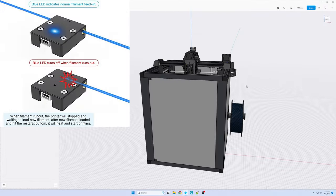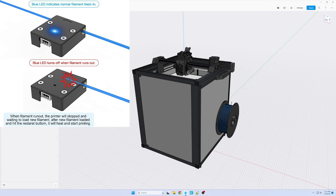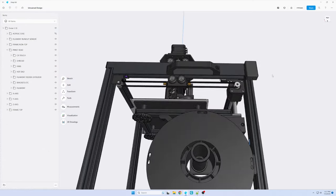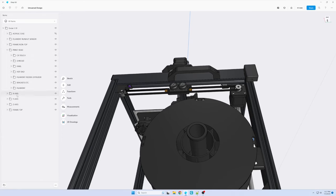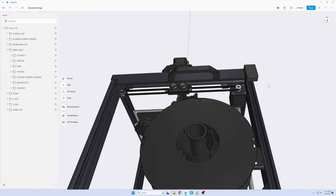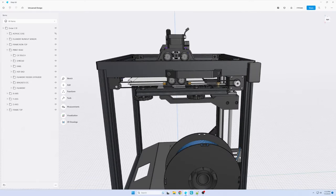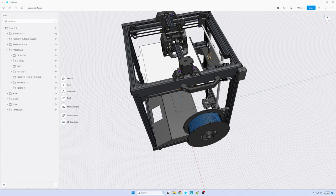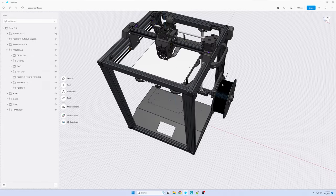The next add-on or upgrade I want to mention is a filament run-out sensor. The sensor sits somewhere between the spool and the extruder. If your filament ever runs out or breaks mid-print, the sensor will detect this and allow you to swap in another spool so you don't have to lose the print job and start all over again. In my model, here is the run-out sensor. The filament starts on the spool, is fed through the sensor, and then over to the direct drive extruder within the print head. If the spool runs out, you'll know before it's too late to fix your print.